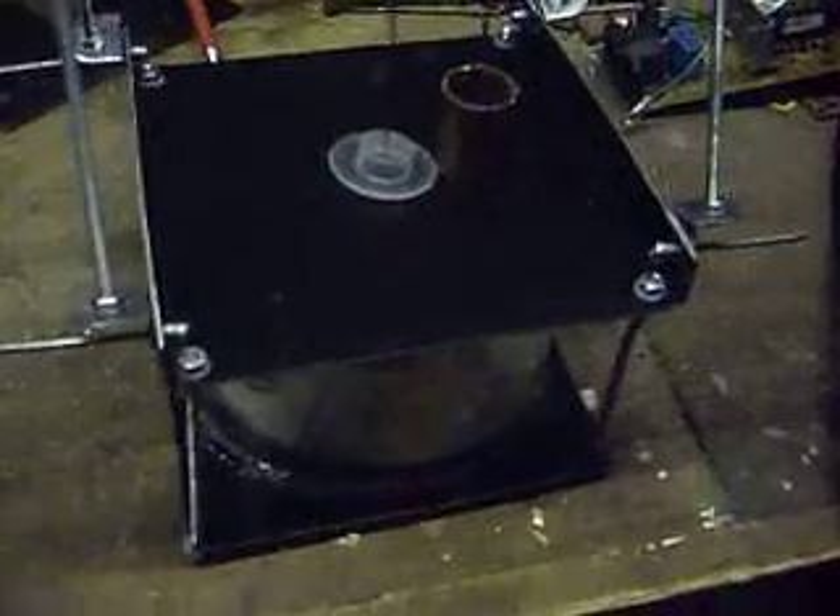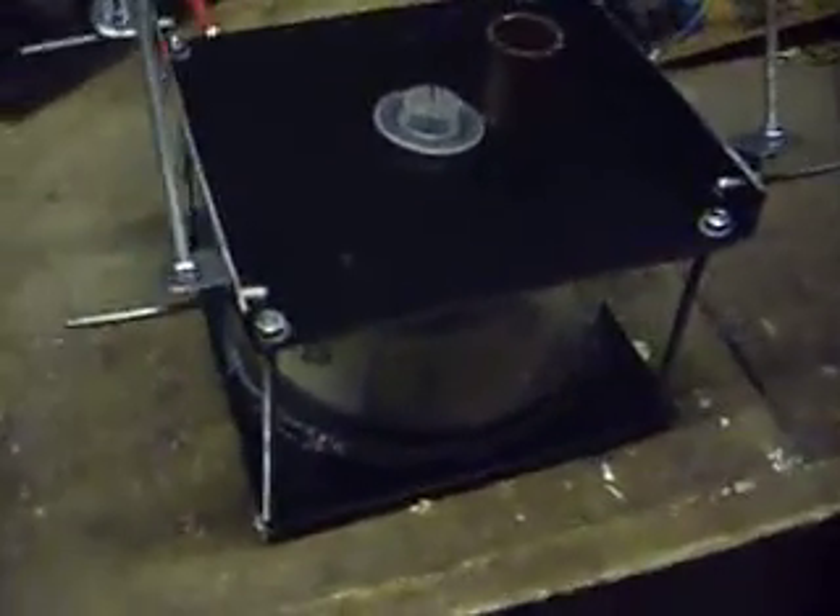If we look down at the bottom, there's the displacer. It's a CD — well, DVD — one that got screwed up as mentioned before. The supports are in place for the crankshaft. I say it's a dry fit, but I have put hot melt glue around the bottom of the cylinder wall to seal it onto the hot plate.